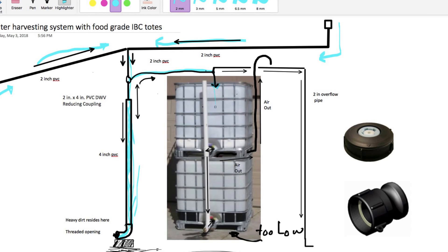As the water fills down, it goes through a banjo connector and into a two-inch PVC pipe, then a T-pipe, and continues its journey down to start filling the bottom tote. To fill that tote, you have to get the air out — so the air goes through a two-inch PVC pipe all the way out. Make sure this vent pipe rises above the level of both totes stacked on top of each other, and close the end with a mesh to let air out but prevent rodents and insects from getting in.